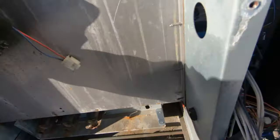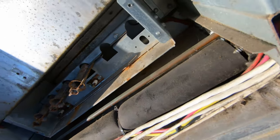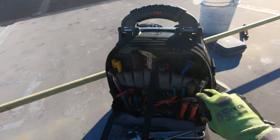All the wires are out and pulled over. I get this burner assembly out — I'm going to need my extension and a right angle attachment. I could probably leave it on and get it out after if we pull the heat exchanger out, but I'll just go ahead and take care of it right now.